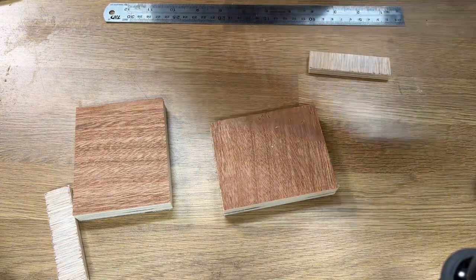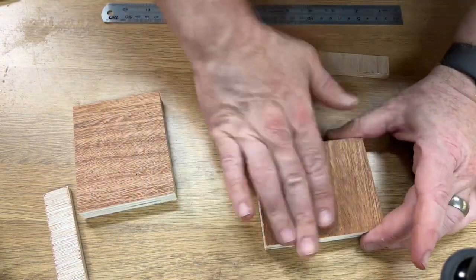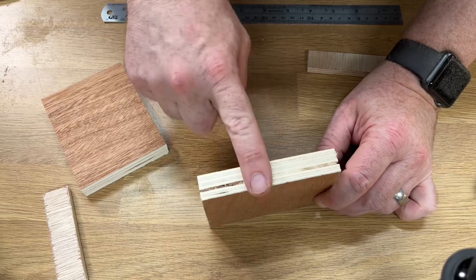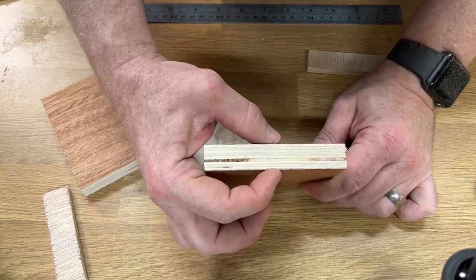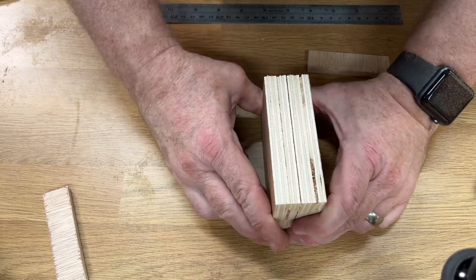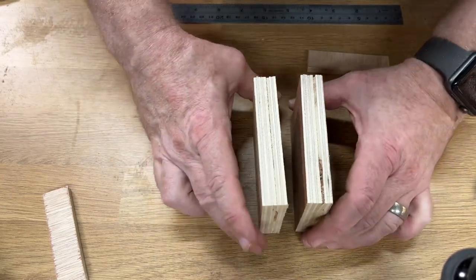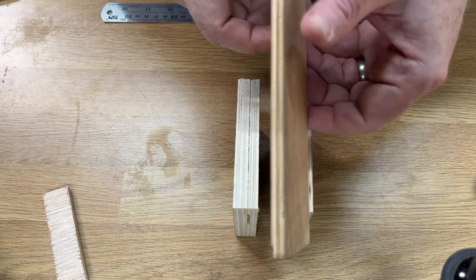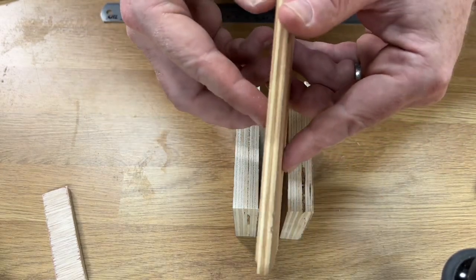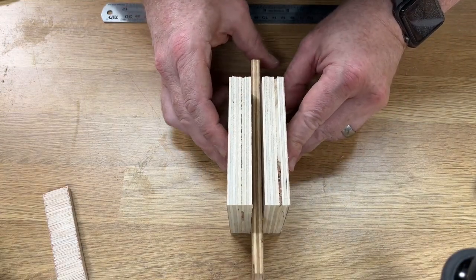The pieces marked A are 80 by 100mm — these are the main pieces of ply. I'm using 18mm ply because the pipe has to go through them and 18mm gives a nice thick grip on the pipe. I didn't want to use 18mm in the middle because two pieces of 18mm would make it a big chunky block, which isn't needed for a 40mm pipe system. So the middle piece — marked B, with C and D the same — is about 7mm ply, and that's what slides between the two outer pieces.